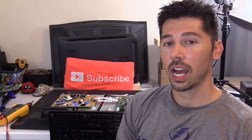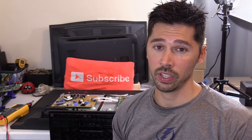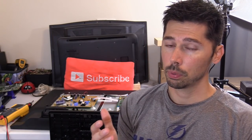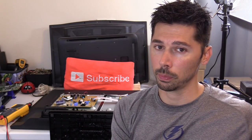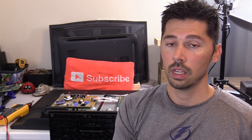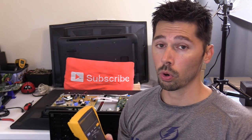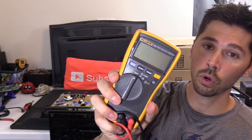I get quite a few comments throughout the years: how do I fix my TV? For example, I have a Vizio TV that has no power — what board do I replace? Well, I could pretty much give you a common solution for a common issue for a particular TV model, but the best way to troubleshoot your TV and find out for sure what board or what component on that particular board is defective is using a voltmeter.